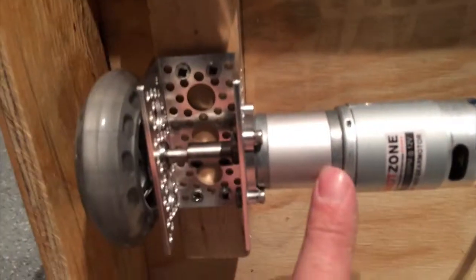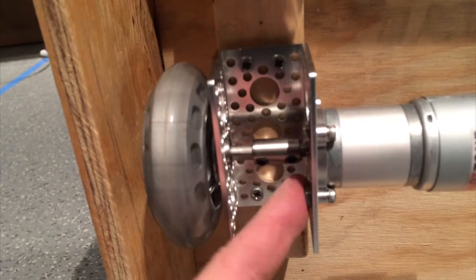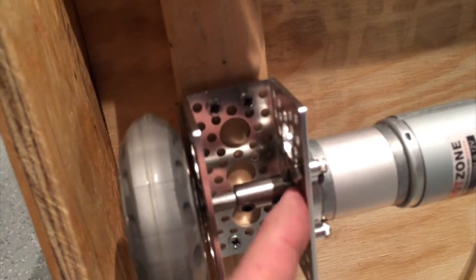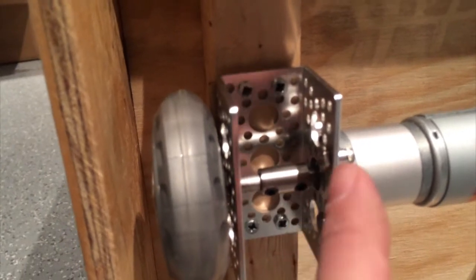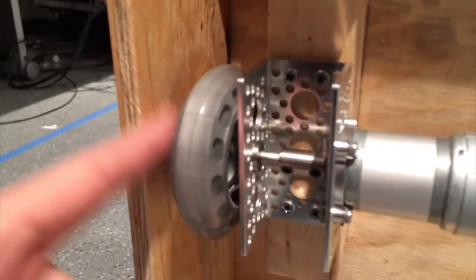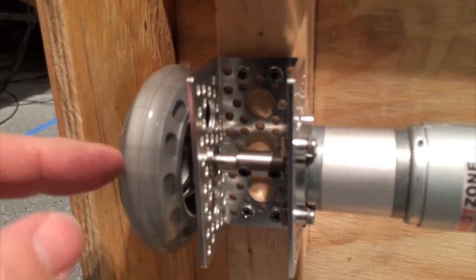There's a motor mount attached to the motor. The motor mount is also attached to this channel. There is a shaft coupler that goes from the six millimeter shaft of the motor to a quarter-inch shaft that goes to this skate wheel that clamps right on the shaft. It's a D-shaft, so everything is locked nicely in place.